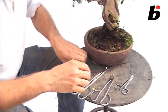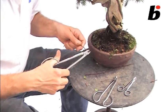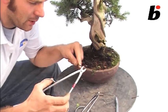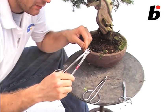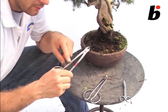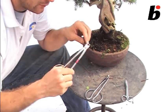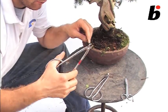All three of these will actually cut up to about two and a half millimetre copper wire very easily, like this. These wire cutters will cut copper wire to about two to three millimetre thickness, but I'm having to squeeze very hard here. If you have to put a lot of effort into cutting through the wire, there's a good likelihood that you'll bend the arms and also damage the cutting edges. So if you've got to press too hard, then you're obviously using the wrong tool.